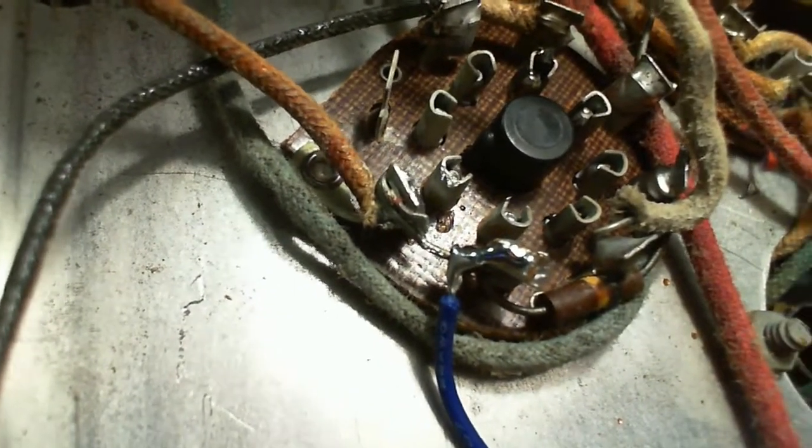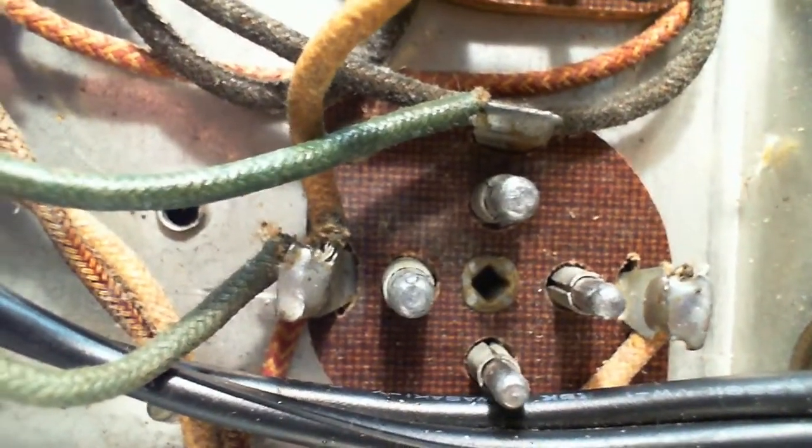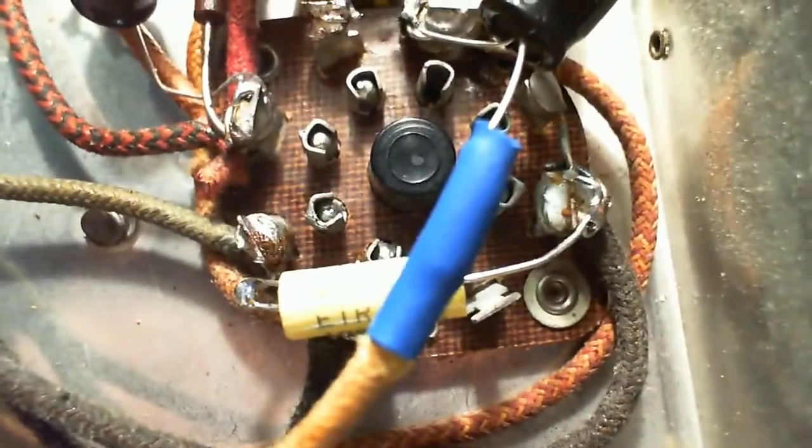Okay, let's go look at this one. There it is, swinging over and getting soldered. Now this would be different. This is the rectifier tube there. I don't think they're going to do anything like that here. There's the rivets for the tube socket, but I just don't think it is handled the same way at all, because the heater is part of the B voltage circuit.